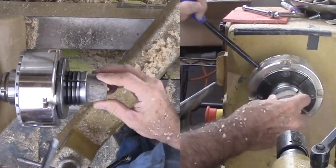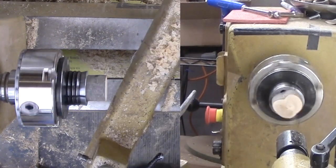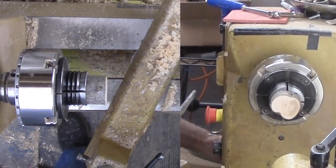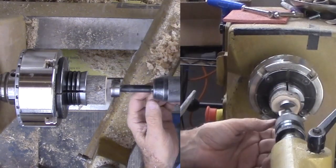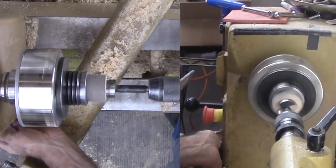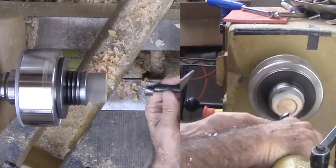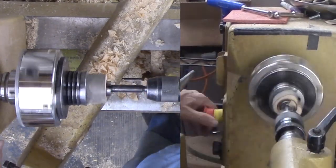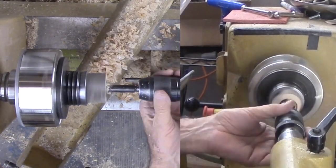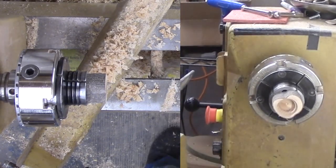I can safely twist it apart because both of the opposing surfaces will be hollowed. Starting with the top, it is mounted to the chuck. To help the drill start well, I cut off the remaining nub in the middle. Then I drill a one-and-a-quarter inch hole about three-sixteenths inch deep — this will be the interface with the base. That is followed by drilling a one inch hole to form the cavity of the lid. For a bit of refinement, a round nose scraper dishes out the point of the drill. I do not want to upset a fellow turner by leaving the point hole.